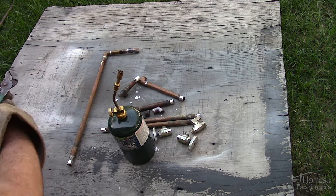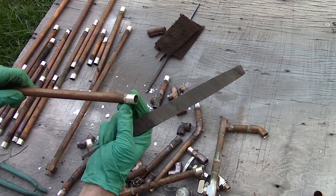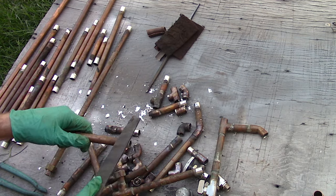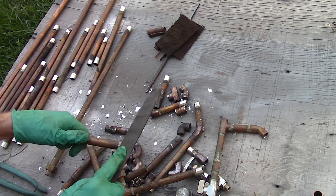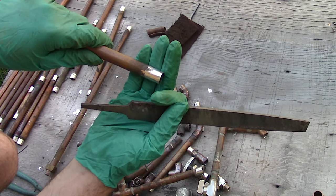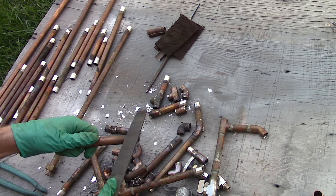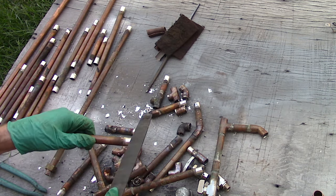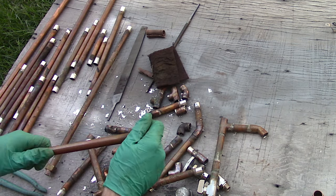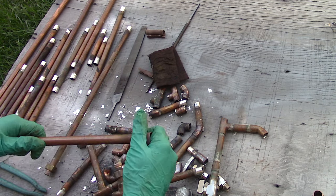Once the joint has become disconnected, you'll be left with a layer of solder on the internal and external surfaces. This won't allow you to slide the connection back together when using the existing side with the other half being new. It's easier cleaning up solder from an external surface than compared to an internal surface. I prefer using a file to remove any thicker buildup of solder — be careful not to damage the copper pipe. Any damage on the copper pipe, or making it thinner, will jeopardize its structure. Next is using 180 grit emery paper to remove the rest of the solder.